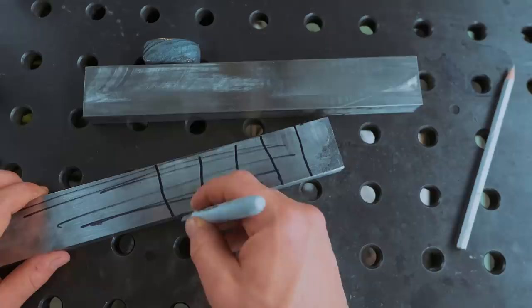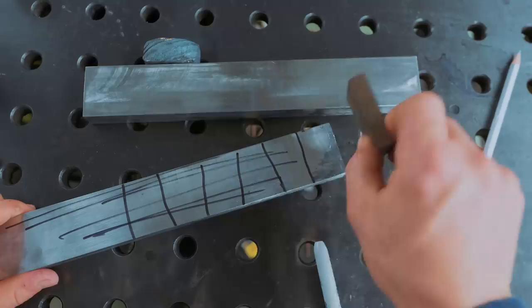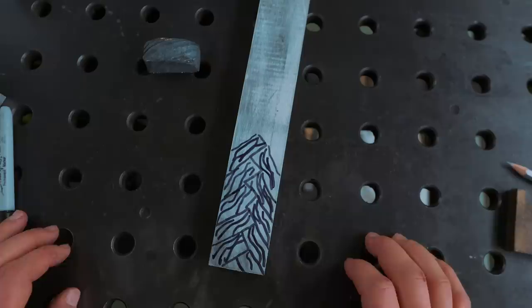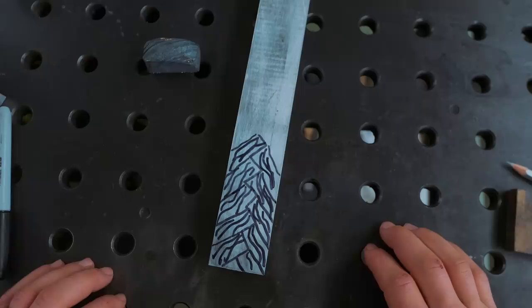And so the plan is going to be as follows. We go ahead and we take cuts like this, dong, dong, dong, dong, dong, and then these pieces are going to get turned up to the sky so that when it's all forge welded together, you see the pattern. And the final pattern is gonna look like a herringbone. And our nice little waviness is gonna, you know, you get the idea. You can now barely tell it's a herringbone, but that's the plan. Looks like hairy Damascus. Hairy Damascus. So we're gonna start making slices.